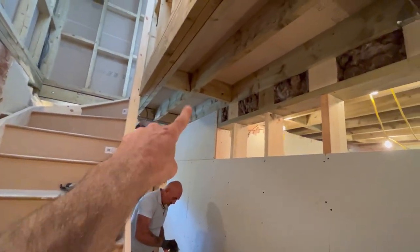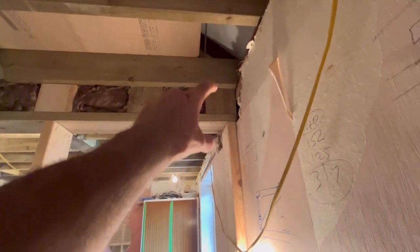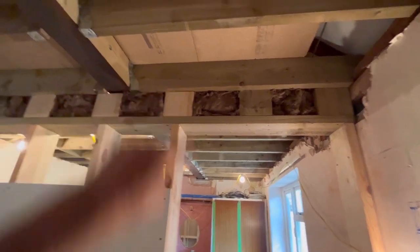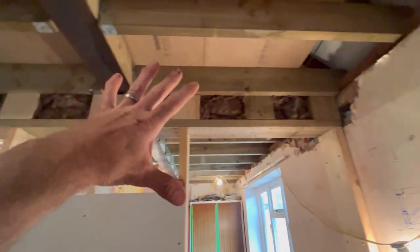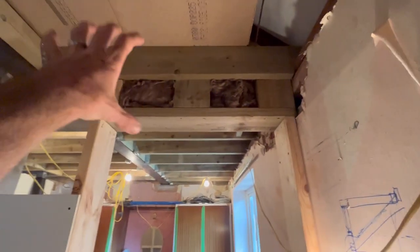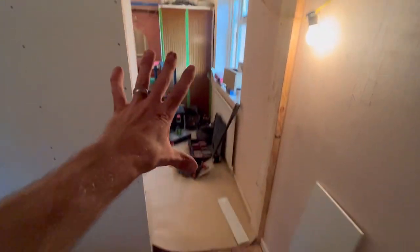Before we move on — unlike the bathroom side where I've been able to go all the way to the ceiling — here I've got the steel behind the wall that needs encapsulating. I've put some off cuts of 72 cut at 145mm, which is the dimension from the top plate to the underside of the floor joist. We've crammed mineral wool insulation into the web of the steel and then put insulating board behind those timbers. That acts as a bit of a wall catcher, so I'll put them level with my studs and fire straight in. We'll get these pieced in now and fit the door frame tomorrow.